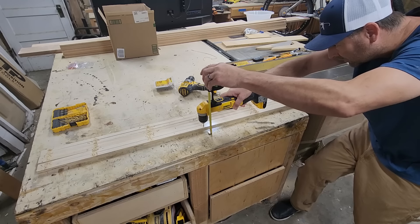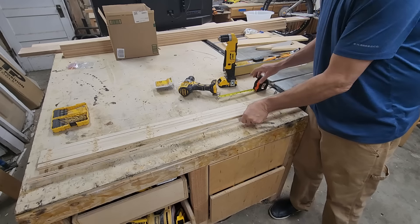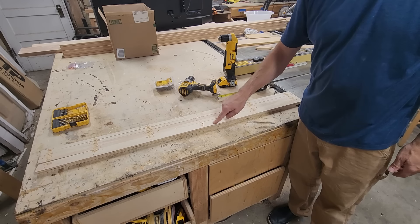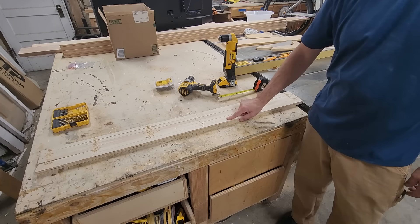I think we're going to be good just at six inches there, and it does grow and shrink as you go around the room. So what would be my solution if I didn't have enough room above the cabinet? It would be simply to glue this on and clamp it all the way around and come back 24 hours later and nail the crown molding to it.